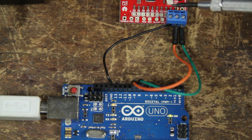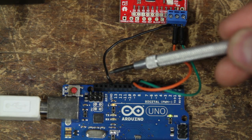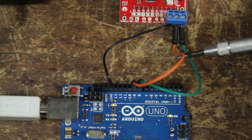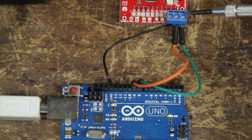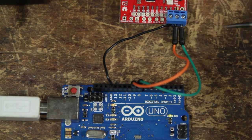The last three connections: the pin on the left is a black cable connecting to ground on the Arduino. The middle pin, this orange pin, connects to digital pin 9 — that is the step pin. The last pin is the green one, digital pin 8 on the Arduino, and that is the direction pin.